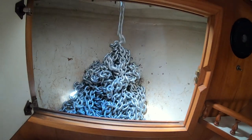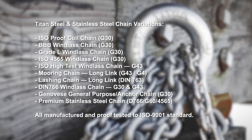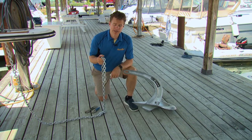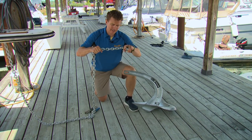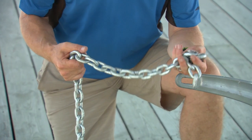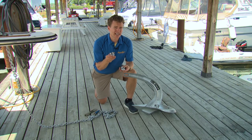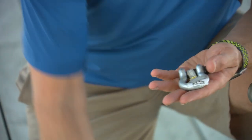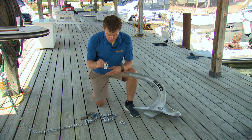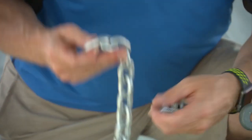With a few feet left on the dock, we set about securing the anchor. All Titan chains are built with precision links, but they do come in a couple of different strengths — you can get G30, G40, and this is the Hi-Test G43 that has a working load limit of 1,770 kilograms or 3,900 pounds. There's no point in getting the Hi-Test chain if you don't also get a Hi-Test shackle. The standard shackle is still fully compliant but only has a working load limit of 2,200 pounds. They do have a black pin shackle that has a working load limit of 4,400 pounds — much more than just this 5/16ths chain. So it's important to match the appropriate shackle to the appropriate chain.